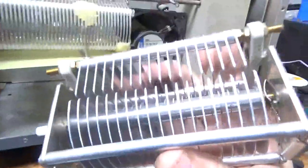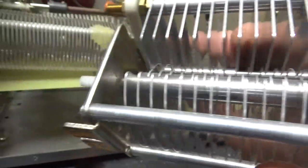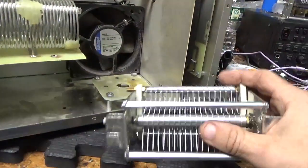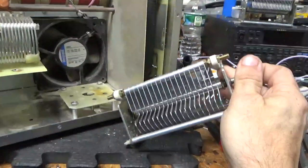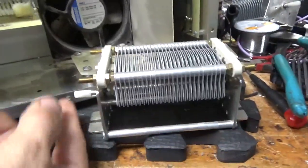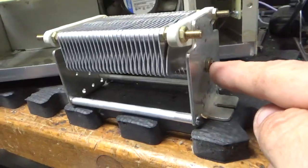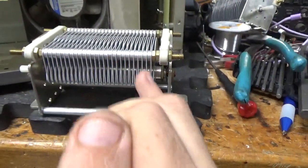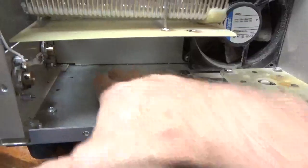Okay, so the old one is out. You can see the damage — it's been arcing in between. Look how easily it spins. The load side wouldn't stay in place; you'd just let go and it would go back and forth. Now the plates are centered — I had to loosen the nut and tighten up on the screw just a hair to push the plates that way, because the rotating plates at ground potential were shifted closer to the fixed ones. I'm going to install the new one, get rid of some of this dust, and get back to work. See you guys soon.